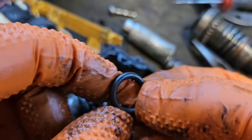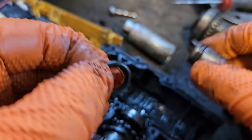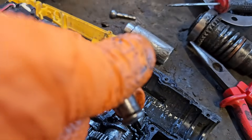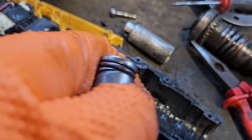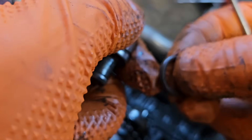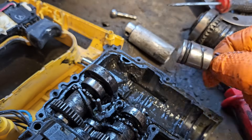This is one of the rare occasions that I don't think I have to replace the O-ring. I'll show you the O-rings. That's this little brown O-ring. That's the original part. It's a 13 by 3 O-ring. I've also been known to use these little generic ones. They're a nice soft O-ring. They're a lot cheaper than the original, but I like them because they're soft. The other ones harden up a lot. I find these good. We call that the striker. That's the striker O-ring.